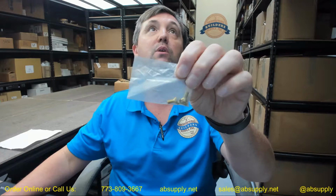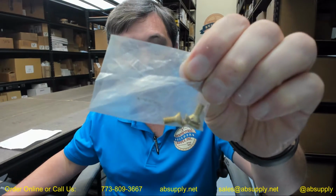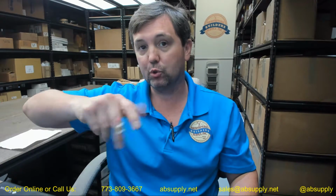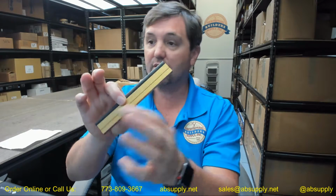But because it's a stop strip, meaning it's intended to go down to a piece of aluminum, it will include machine screws. Meaning machine screws, you'll have to drill and tap into whatever you're attaching it to. And sometimes I see these drilled and countersunk. Other times I don't see them drilled and countersunk for the screws.